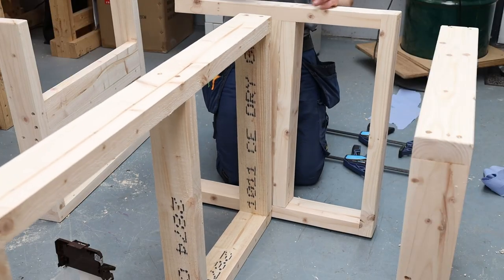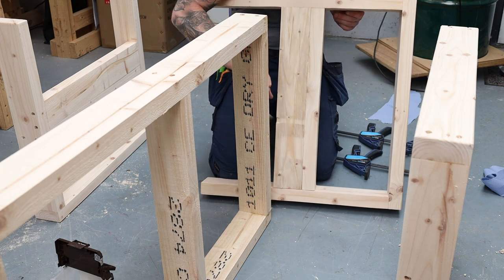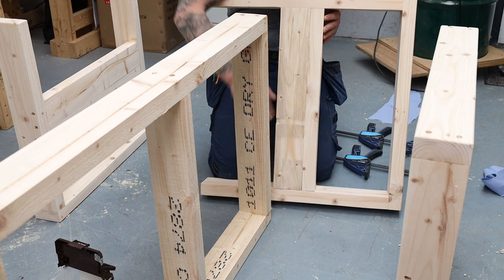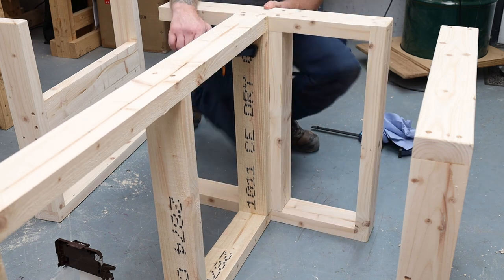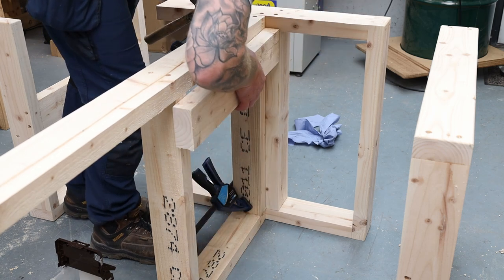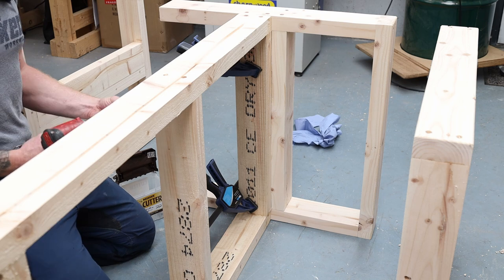When attaching the arms and legs to the frame, the mounting plate piece we built in screws directly to the frame. Keep the bottom edge of that 4x2 directly in line with the frame edge, because all the bench-top planks will run flush with it. Put plenty of glue on this joint and screw it from the inside as well. Take your time, clamp it down, get everything lined up, then drive the screws home — these won't be visible on the inside so no countersinking needed.